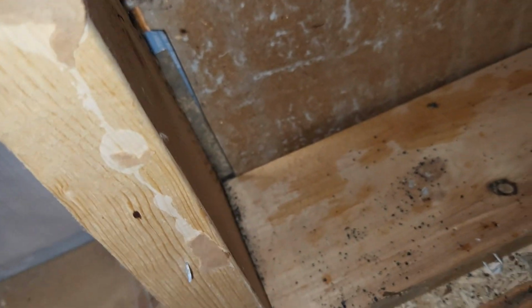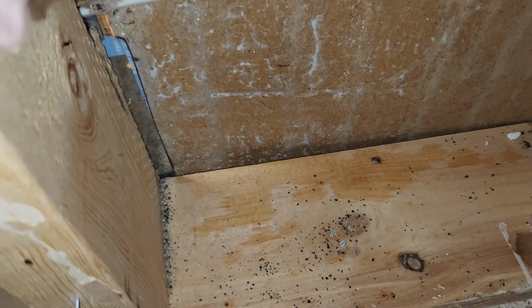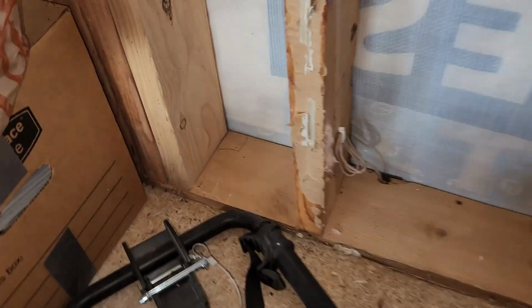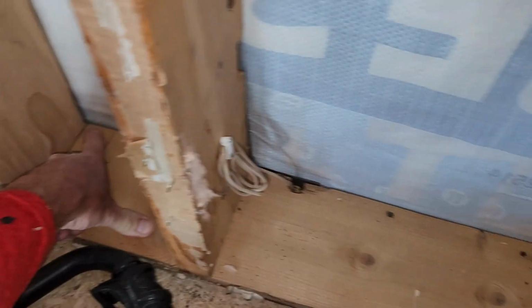Actually, oh goodness, I can actually see light coming through this. This panel is going to be completely replaced, but as you can see, there's already previous hail damage, and it's not really nailed in properly. So you can see that water is coming in this edge here. Everything else looks good. And then I did have a marking here. I had a few water drops there. Not this time, but again, just make your marks, make your notes, and then take the time to go around your windows and check for any moisture.